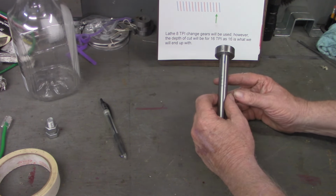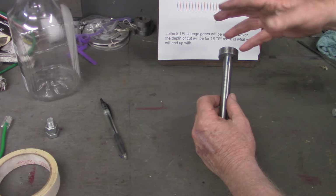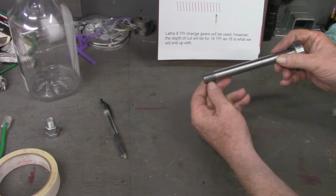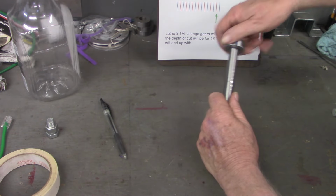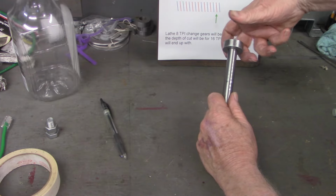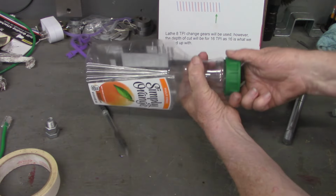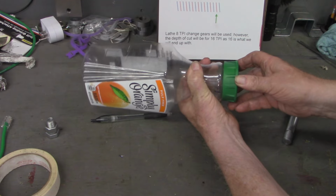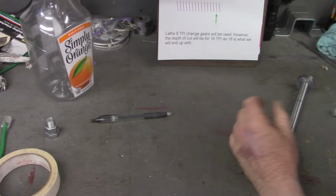Where that comes into play in the industry a lot is steam valves, water valves, items like that where you still want the fine thread, but you want to be able to get to that end point with less amount of turns. Again, with this exaggerated example here, we see from the click there, that's all it takes to lock it down. Less than a third of a turn.